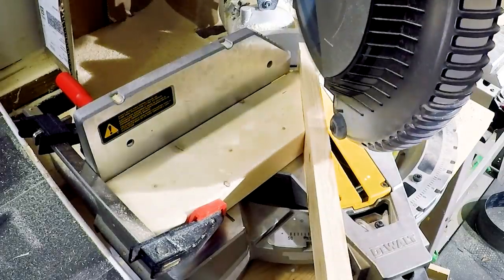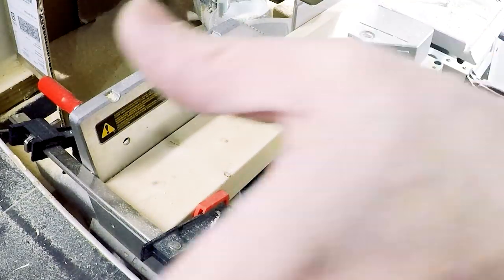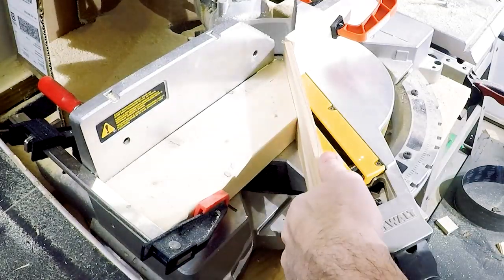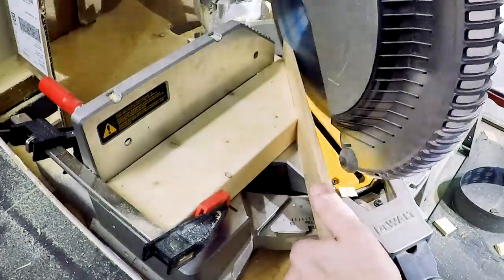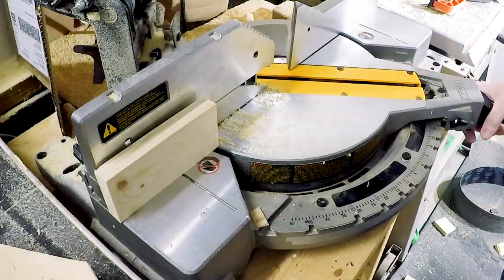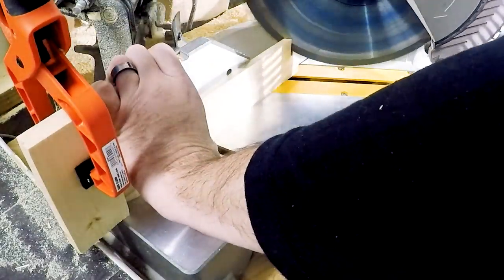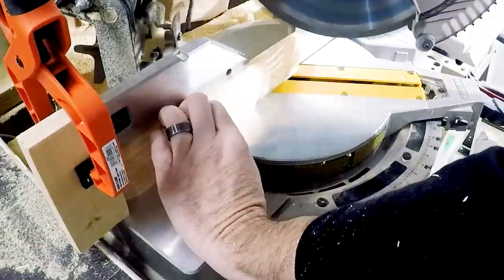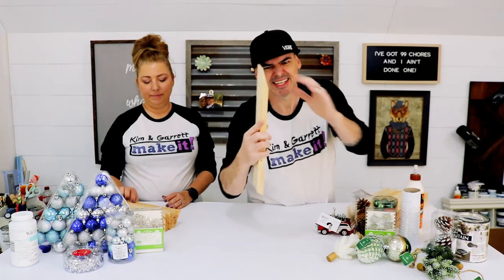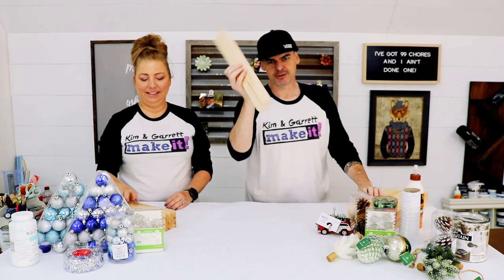We're gonna make 10 cuts of the 1x3, and then we'll make those same 10 cuts using the same jig for the half-by-3. And we got all of our 18-degree cuts made. Now we're just going to set up a little stop block and cut all 10 pieces the same length using a 36-degree cut, which when we flip it over will be the 54-degree. We're gonna cut all of the 1x3s and all of the half-by-3s. All our pieces are cut — tight little 18-degree on one side, and then that laid-back 54 on the other. Two cuts, 10 pieces.